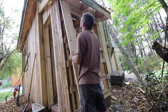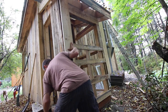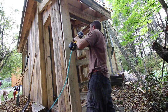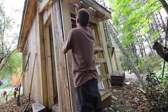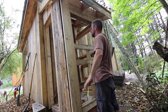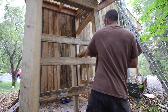The video's not over yet — it just means in the next scene it'll be the afternoon, just like this. I'll be able to go to the lumber yard and get the right width board I needed for right here. I'm just gonna flush it up with the inside of my window. Tack it in place. We're gonna have this trimmed off later on, so this little gap we can fill with a board or leave it because our trim work will hide it. We need to cut quite a few at 45 and three-quarters. Let's see how far we can get with these six boards.